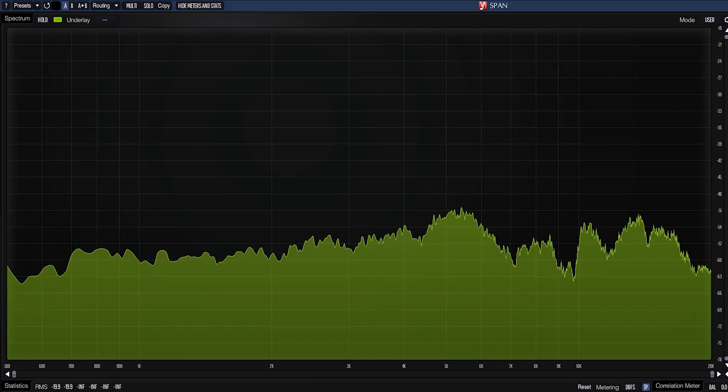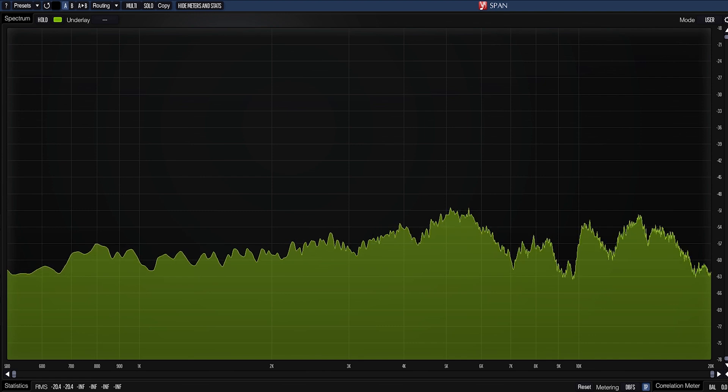Based on that, I would assume that our blimp is going to make things even worse, but it's actually not the case. The overall tonality of our microphone is basically unaffected, with no significant loss of high-end. We are getting some frequency-specific dips at roughly 7k, 9.5k, 12k, 15k, and 18k, but those dips should be less noticeable than a broader loss of frequency.